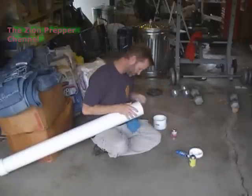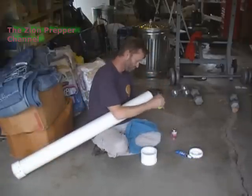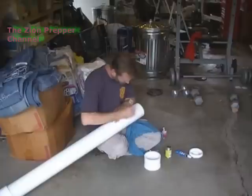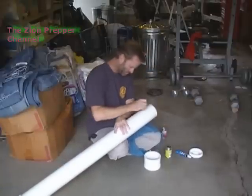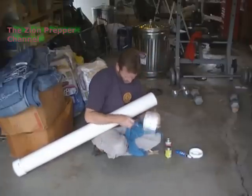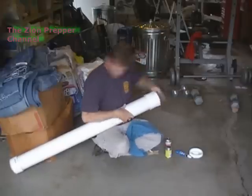Here I'm doing it all over again but in high speed — doing the other side as well. I'm cleaning it, putting the cleaner on, which is that methyl ethyl ketone. Then I'm putting the glue on — I'm going so fast I can't even tell what I'm doing. Putting a lot of glue on to make sure it's nice and covered, putting some glue on the inside of the other end cap — that's the one with the threaded end. There we go, I put it all together and I'm putting a lot of pressure on it.